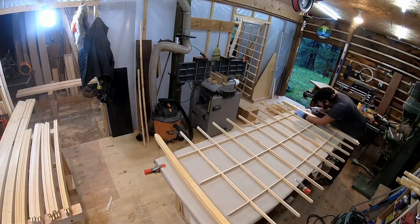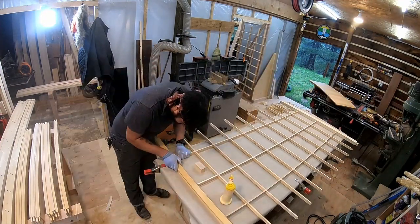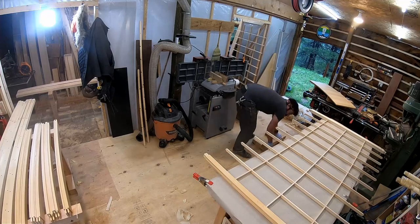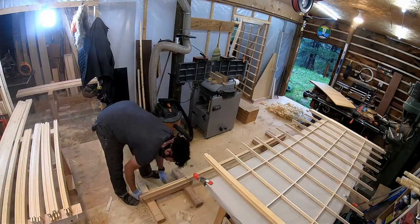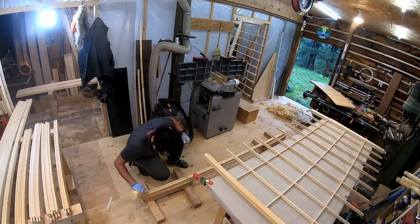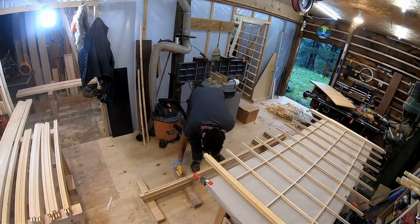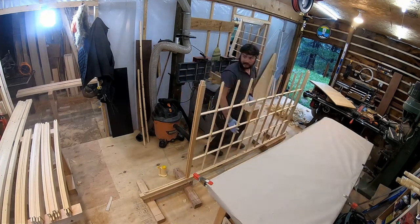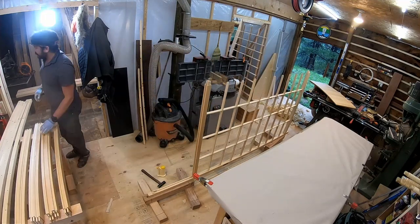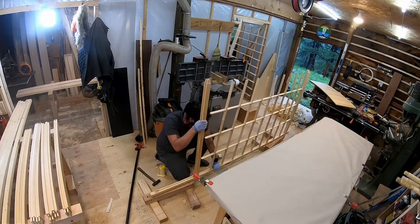And once we have our lattices together, now it's the real show, the real stress of the glue up. We got these thin little pieces, and they all got to go into these little holes, and they all got to go in correctly and at once. And especially on the kumiko, there's no tenon shoulders on two sides. So if you don't get them in the right place and you're not paying attention when you clamp them down, it's going to force that tenon into the side above or below the mortise and crush the fibers. And it'll be super visible because there's no tenon shoulder to hide it. Whereas the other tenons, if there's a little bit of misalignment and it mars the entrance to the tenon, that'll get hidden by the shoulders.